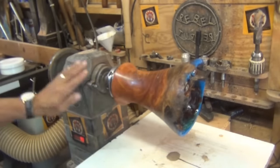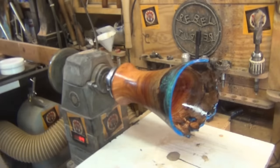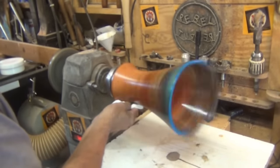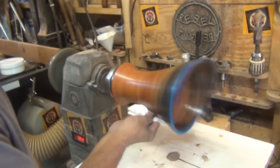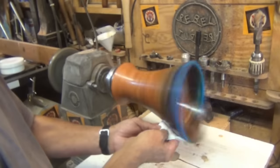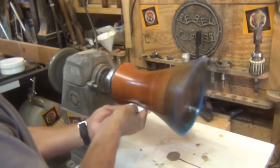Now the finish that's here is already an acceptable finish. Just as is. No high gloss, no nothing. The inside just has the 2 coats of lacquer. So far this piece has not taken any OB shine juice. Just the sanding up to the fine steel wool, Yorkshire grit, then the lacquer, 2 coats, light sanding in between the coats with the steel wool, and now after the steel wool, I'm applying Yorkshire grit.